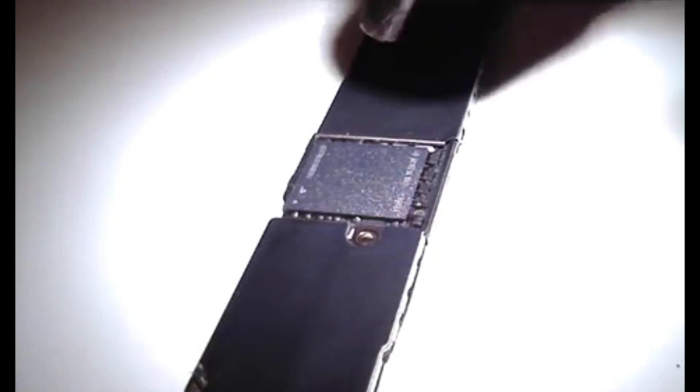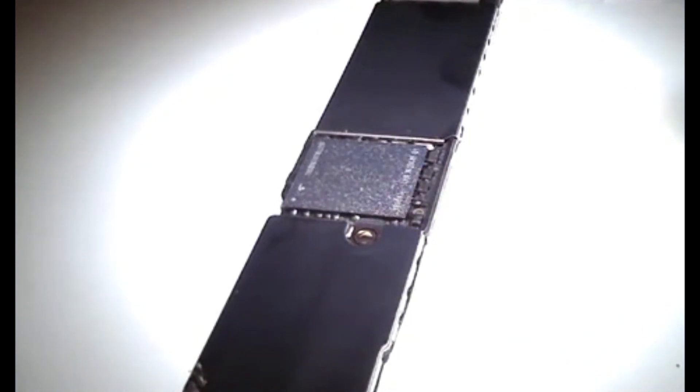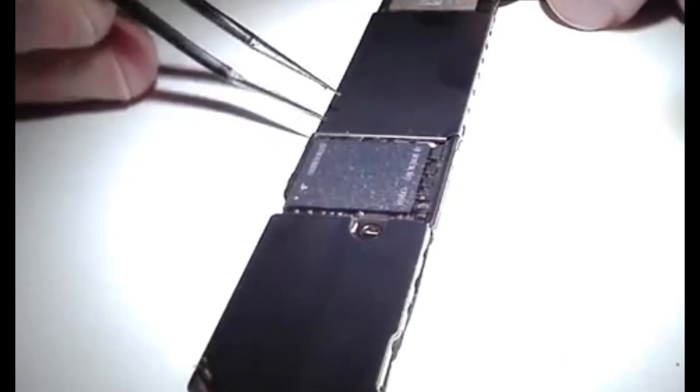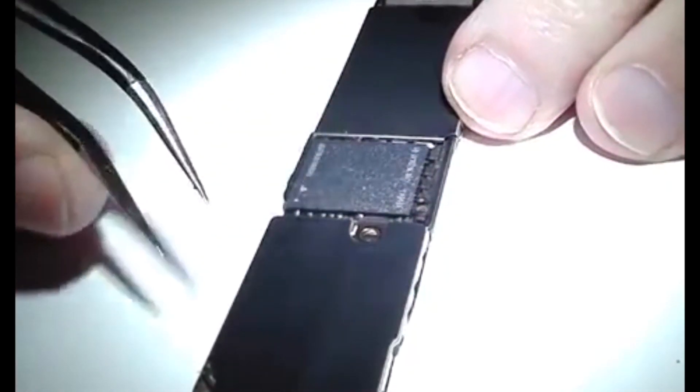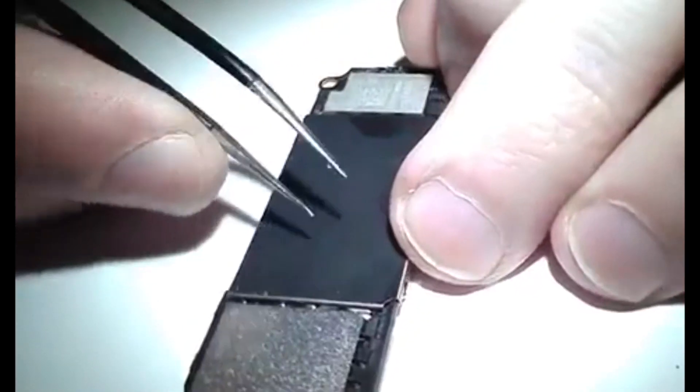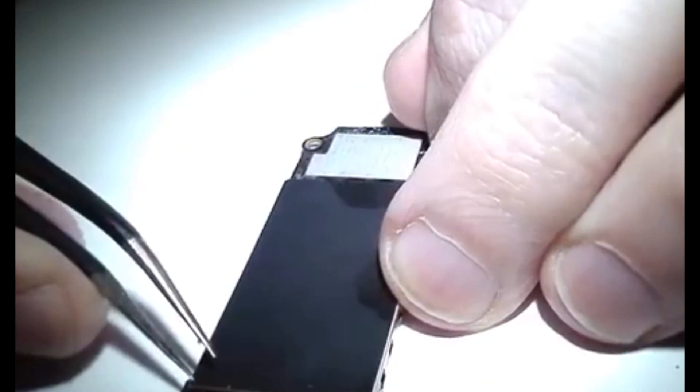Okay, we're going to get into this repair. We begin by heating this board up just a little bit with about 100 degrees Celsius. What this is going to do is loosen up the adhesive on that sticker. And then we're going to go in here and simply remove the sticker with a sharp pair of tweezers. You can also do this with a knife. But you just want to get underneath it and underneath the adhesive, so that when you're done with the repair, you can actually reuse this sticker.